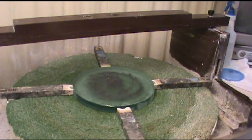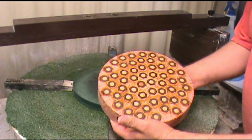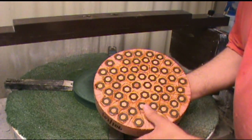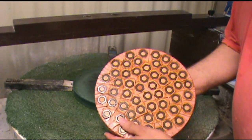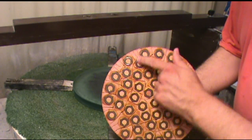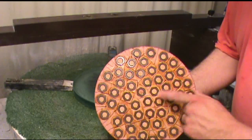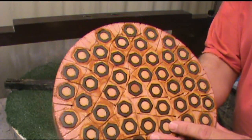Now we configure this for fixed-post grinding. I have this steel tool — it's made out of steel nuts embedded in a dental plaster substrate. Between the steel nuts I've used a diamond tool to route out channels, and that helps to allow the abrasive to distribute evenly.